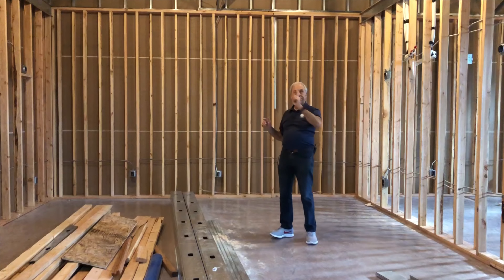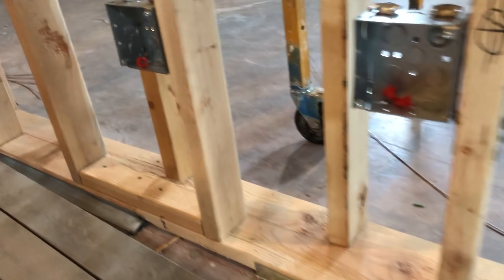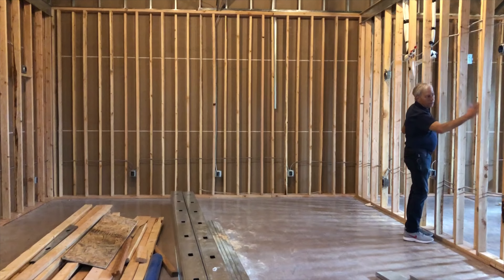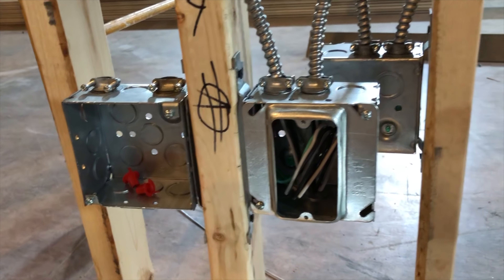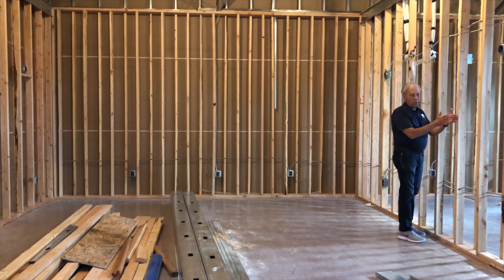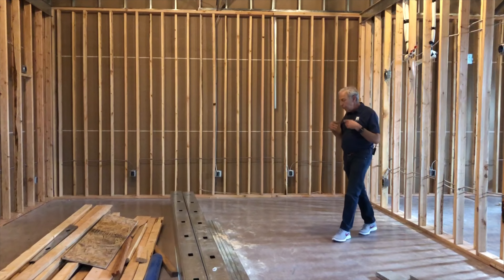So crown molding all the way around, then corners, and two walls actually. On one board there are actually two walls — Music Room 2's walls are here and here, and you can see there's another stud pushed away by a two-by-four, and that's for the other wall in Music Room 1. These are completely isolated walls, and then we're going to double sheetrock here — 5/8 inch sheetrock doubled, so 10/8, that would be an inch and a quarter of sheetrock to keep the sound down. And then in here, all kinds of insulating material.